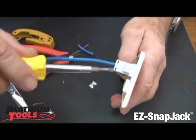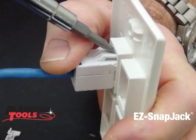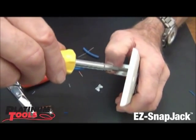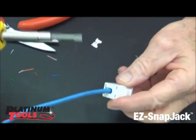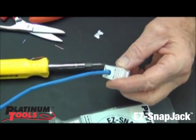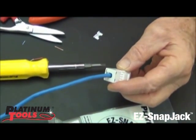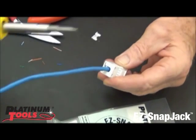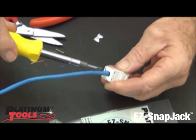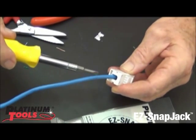If you have to take these out, go in here like that, put a little bit of pressure down here — when I release it I'm going to feel it — just right there. Open up the jack, because you can reuse them. Let's say your cable's too long and you want to take a foot off, make it shorter. Just take your screwdriver, put it in the little tab, sort of twist it, and pop it open like that.